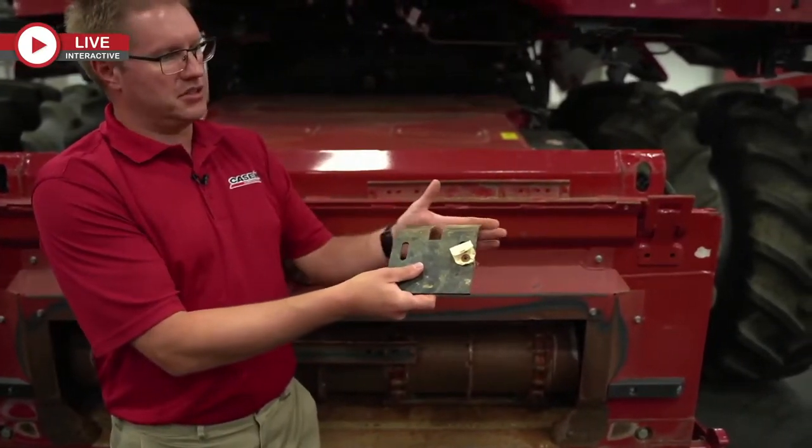When we're talking about grease for our Case combine, it's really important that you use a lithium-based grease, not moly. Lithium grease is meant for high-speed bearings. Do not over-grease the bearings — don't pump them until you hear stuff squishing out; that's over-greased.